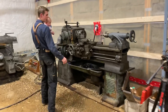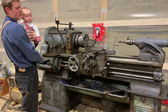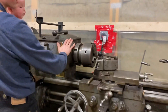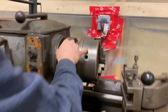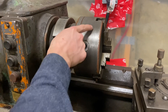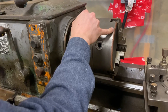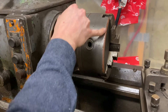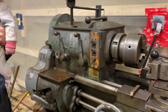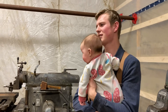The cluttered racks are another result of the springtime humidity and the wet floor. On the lathe, I actually polished up all the rust off of it recently and oiled it, but you can see exactly where I forgot to oil around this ring. Even when I wipe my finger on it, you can see the moisture coming off. It's actually rusted this edge really bad, so I need to polish those surfaces up that I missed and re-oil them because they get rusted very badly, very frequently.